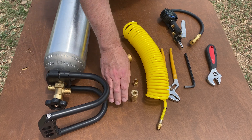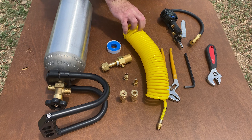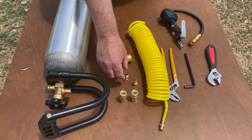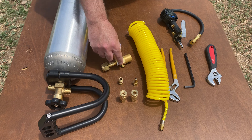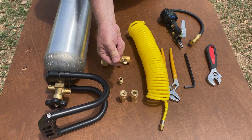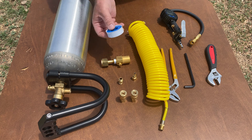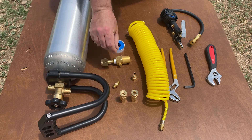The other thing we're going to need are these couplers — those are six ball-bearing couplers. The reason I like using the six ball-bearing couplers is because they do a better job of holding everything together, and they don't let a whole bunch of air leak out when this hose moves back and forth as you're using it. We're going to need this male-to-male adapter, and this goes between one of the couplers and the regulator. And then we need a hose end to plug into the other coupler. We'll also need some plumber's tape just for the threads on these when we put them together to make sure that they don't leak.